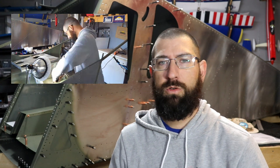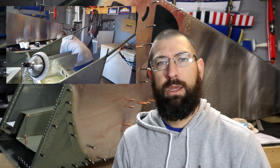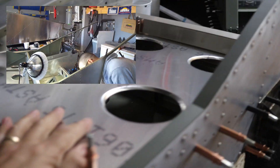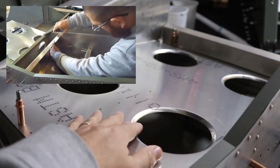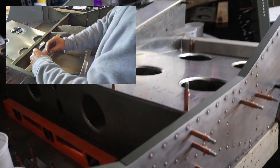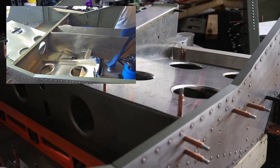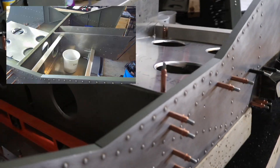So let's head over to the front panel here, or the front side of the fuselage, and take a look and see what we have going on now. Okay guys, so like I said, the new replacement parts came in and as you can see, everything fits in there perfectly on both sides. So that's great because that means that the fuselage front section here is now square and flat. So lesson learned — take a little bit of extra time, make sure everything is flat and square and level before you start drilling out holes.